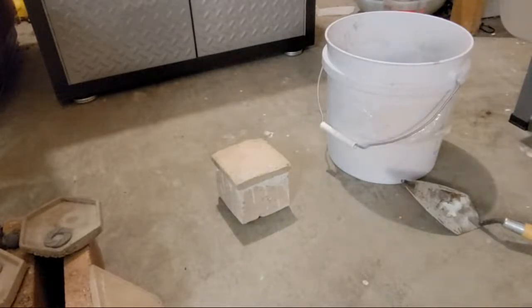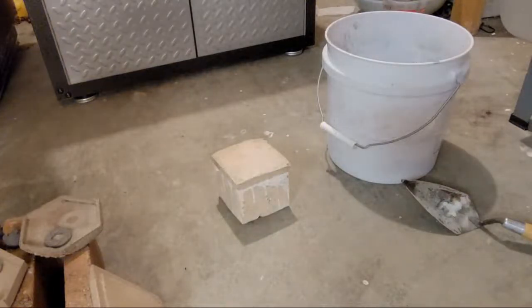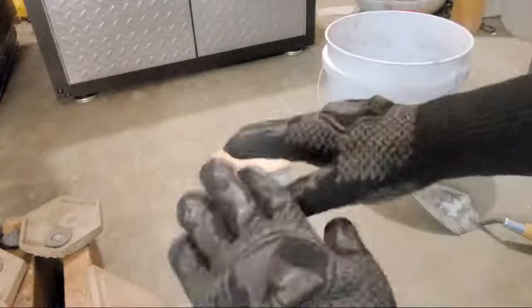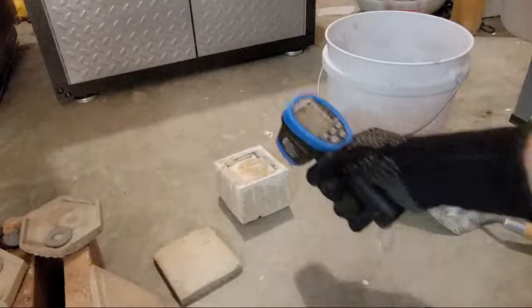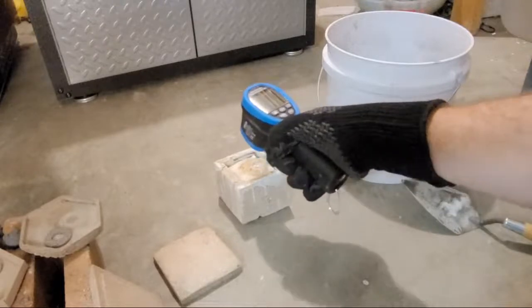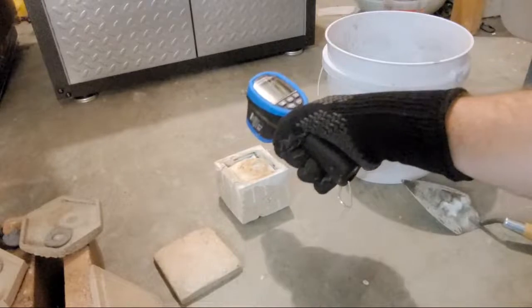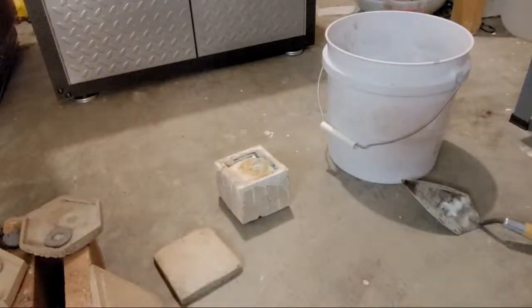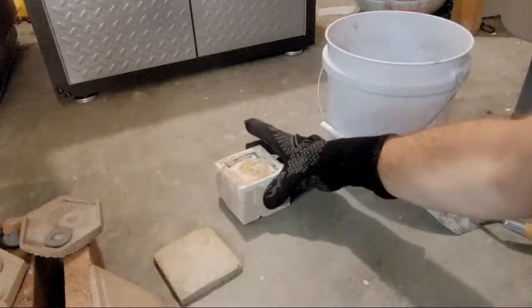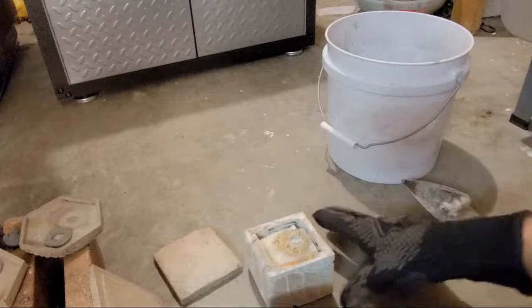While I'm putting on the heat-resistant gloves — for anyone just popping in, we have an aluminum part that we just sintered in the microwave, hopefully successfully but uncertain. First thing I'm going to do is take off the lid. Let's take a measurement here — very reasonable. This has cooled down for about 25 to 30 minutes and we're sitting close to 400 degrees peak temp, which is well under the max rating for these gloves.